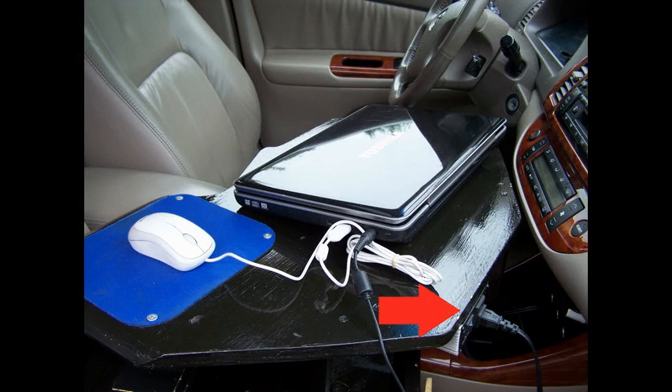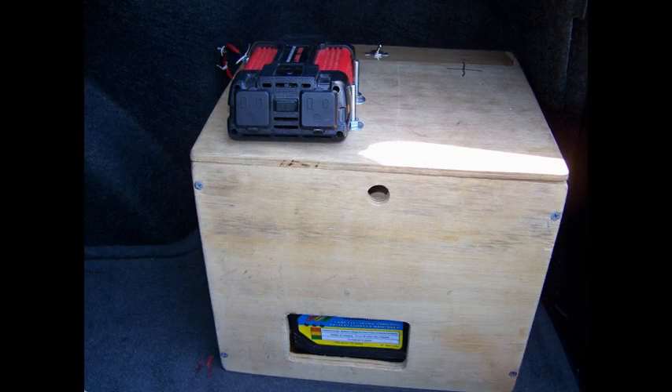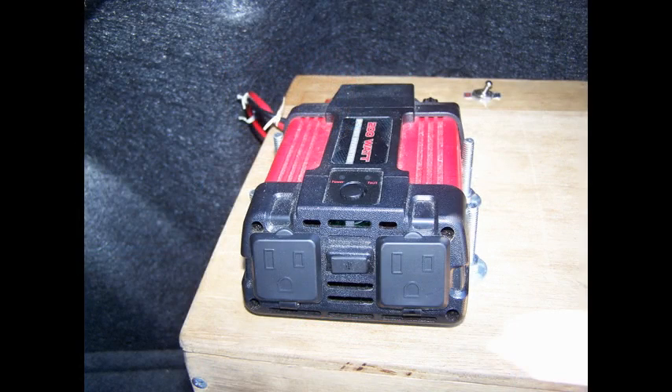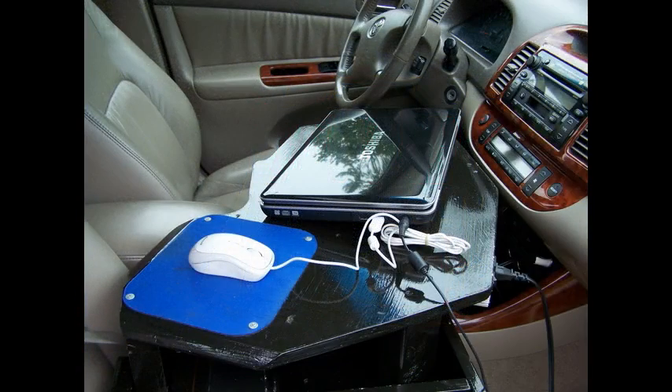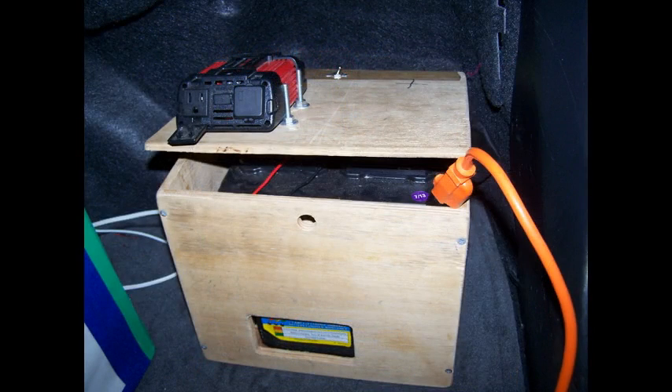Here's a problem with what we've covered: routing a DC voltage from the trunk to the inverter in the front of the car is very inefficient — it requires large wire and you have some voltage drop. The fix is to simply move your inverter back to the battery box and mount it directly on top so you can get to it easily. Now your DC current path is two very short wires with no voltage drop. You then run an extension cord from the inverter up to your appliance, since AC voltages travel very well over great distances — that's why we use it in houses. Two advantages: one, this is now a self-contained portable 60 Hz power supply, easily moved to any location desired; and two, if you're using this as an emergency power backup, you can plug in the battery tender, let it sit, and it'll take care of itself until you need it.